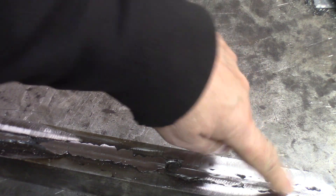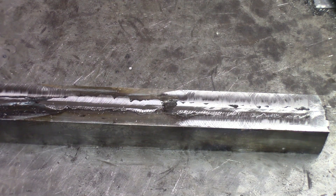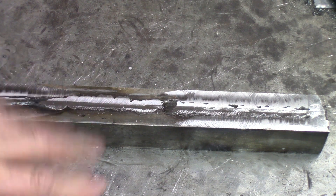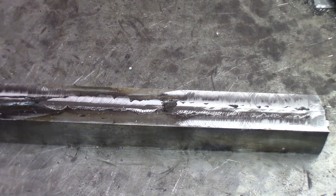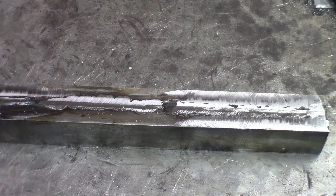This is the side with the V-groove, the prep. I cleaned up near the edge. I wasn't very comfortable when I welded the undercut, but that doesn't affect the bottom of the weld. We will just go to the saw, cut these in parts, polish and etch.